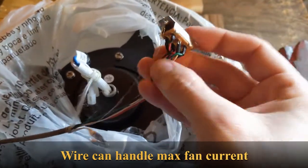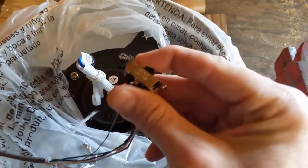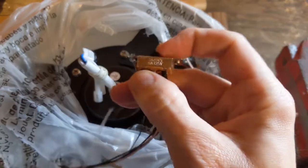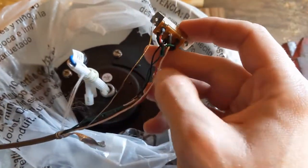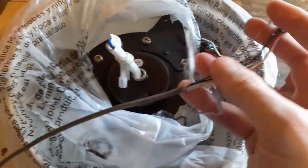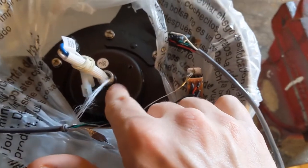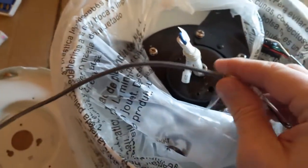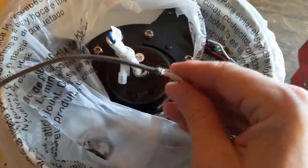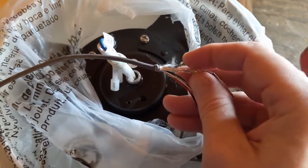This one I burnt up right here, but you can see - I'll throw up a diagram. What the switch does: this is the neutral position, this is one direction, this is the other direction. Essentially what you're doing is you're taking the source and flipping it to one side or the other side of the primary coil. I chose 22 AWG because it'll fit inside the hole where I'm going to access it on this one.